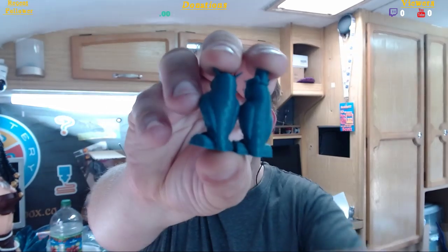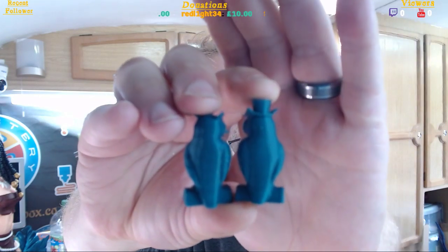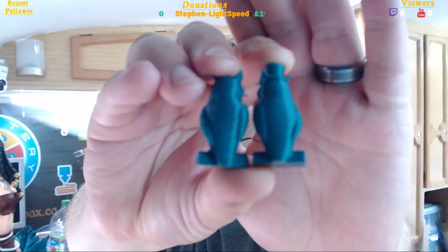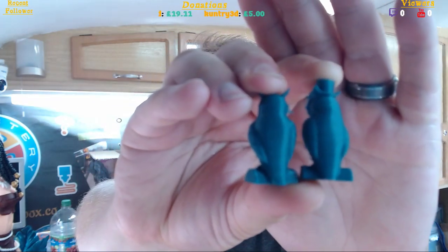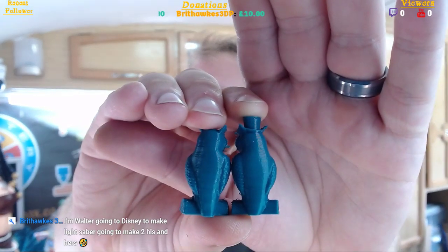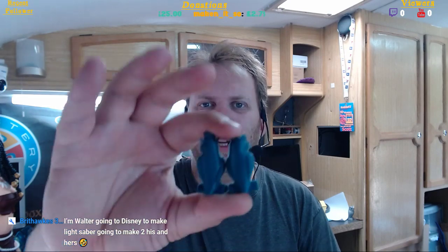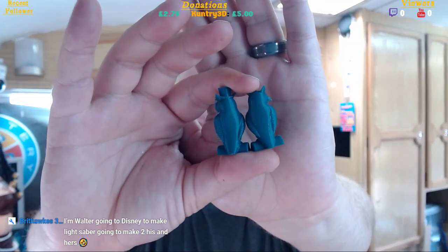It sounds like the Predator's on the second line. I don't know whether anyone saw my pictures on Twitter the other day. These were the two prints that I did before I found that the lead screw was bent. Come on, focus. I don't know if you can see the black banding at all on them. Oh, yeah, you can see the black banding slightly darker. Well, I found out the lead screw was binding, so I finally got the new one, fitted it Friday, and printed the exact same G-code and no banding, which is great.